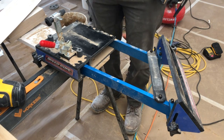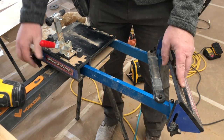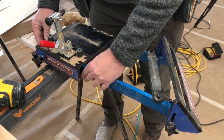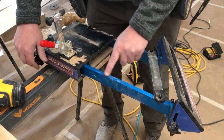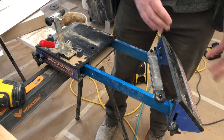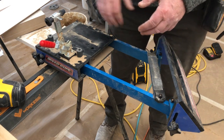Alright folks, this is my favorite tool — my current favorite tool. I can see my wife rolling her eyes as I say that — I have a lot of favorite tools. So essentially this is the Speed Cope. It's fully adjustable and allows for inside corners, left and right. I'm just going to adjust it with this left-hand cope that we cut a moment ago and tighten it down. I have a little magic marker mark on the rail so I know when I'm at the correct angle. Also, this front tilts down and up to give you the amount of back cut that you desire. I currently have this one set on 50 degrees bevel, and it seems to work great for what we do.